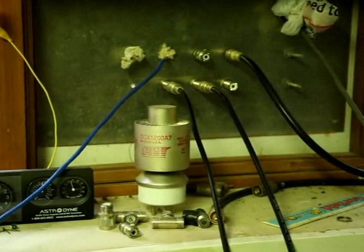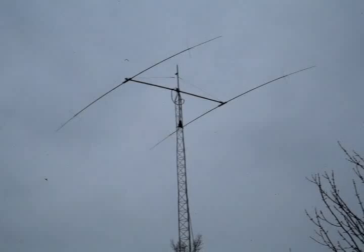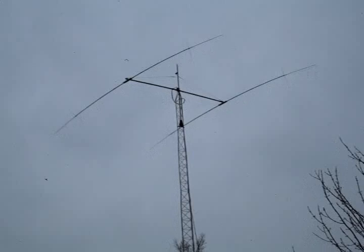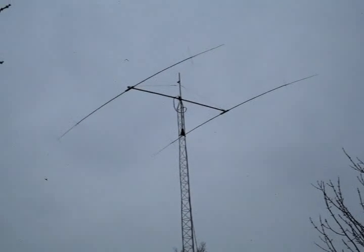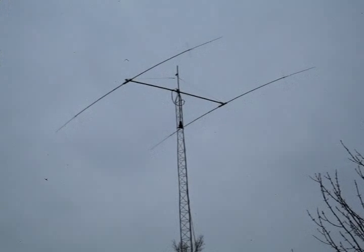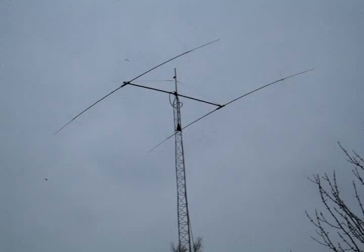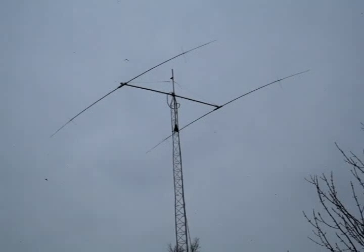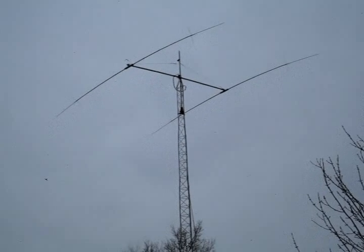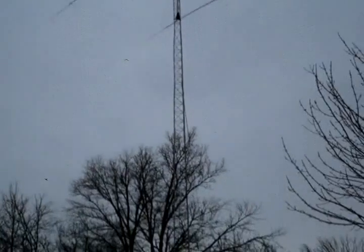Next I'll show you a quick picture of the antenna setup. So we're outside. This originally was a Cushcraft two-element, 40-meter monobander parasitic array. We went ahead and did a slight modification to it so that both elements can be driven rather than a parasitic array.